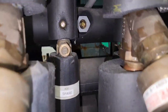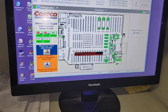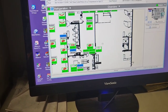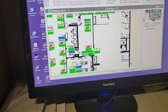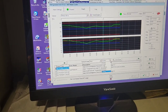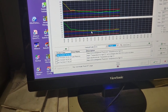So we closed A02, and when I did that a little bit ago with both of them, I closed A01 and A02 to simulate and flush more refrigerant over to A07, which is my big walk-in. When I did that earlier I noticed a big improvement in it. My improvement was pretty rapid, and that was right here.